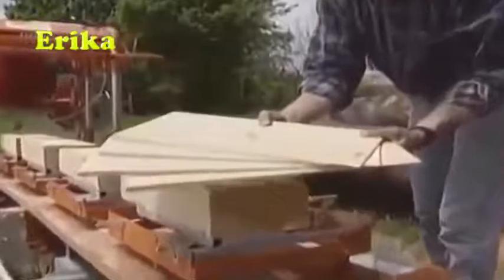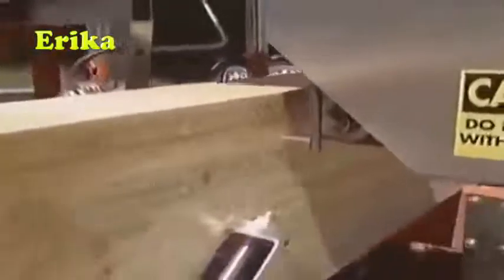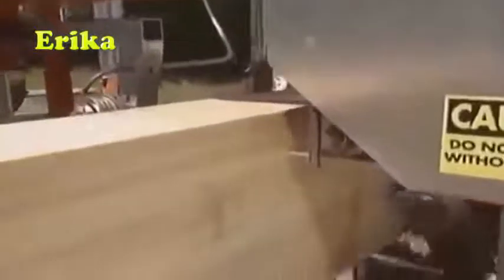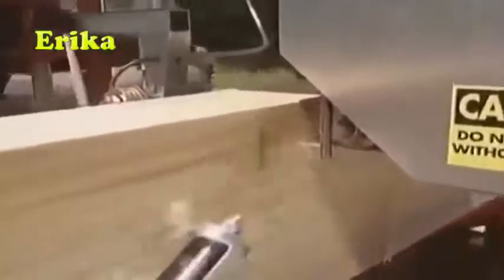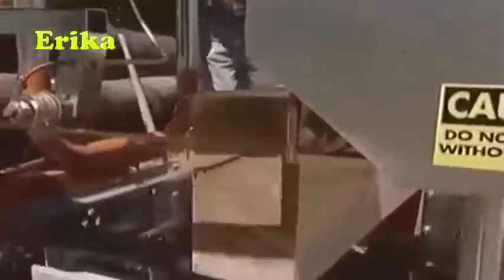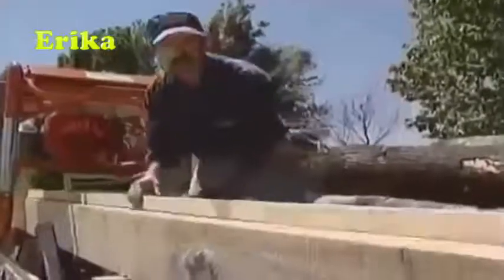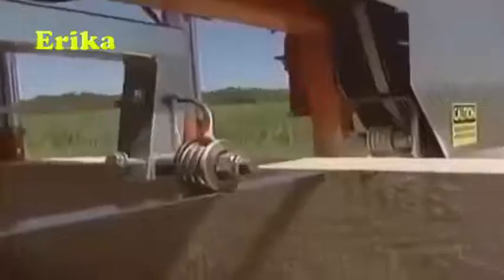The LumberMate will saw shingles and lap siding. It will saw dimensional lumber, beams and planks. It will flat saw and quarter saw. It can edge, resaw, and resize. You can mill 2x10s, 2x6s, 2x4s, 4x4s, 24-inch squared beams, or thin 1/16 of an inch veneers.